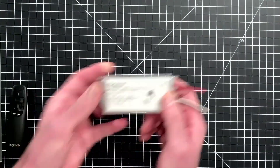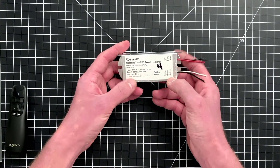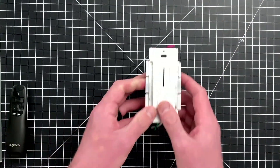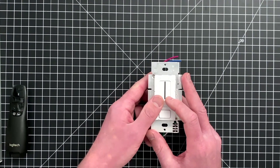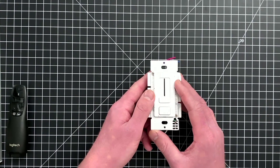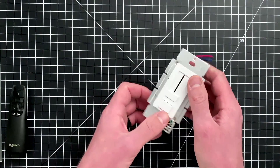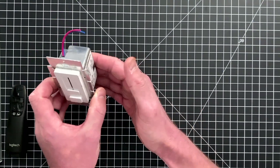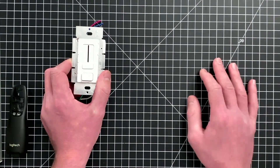The OmniDrive Basics is a smaller, more cost-effective option — it's ELV only, not universal, but still a great value. And then our famous Switch X, which is a driver and dimmer combination. Be ready — we will have a really big update on the faceplate next month. It's a great product specifically for under cabinet and similar areas where you don't want to hide the driver. The driver sits right behind the dimmer, fits in a gang box, and dims all the tape lights we've discussed very smoothly.